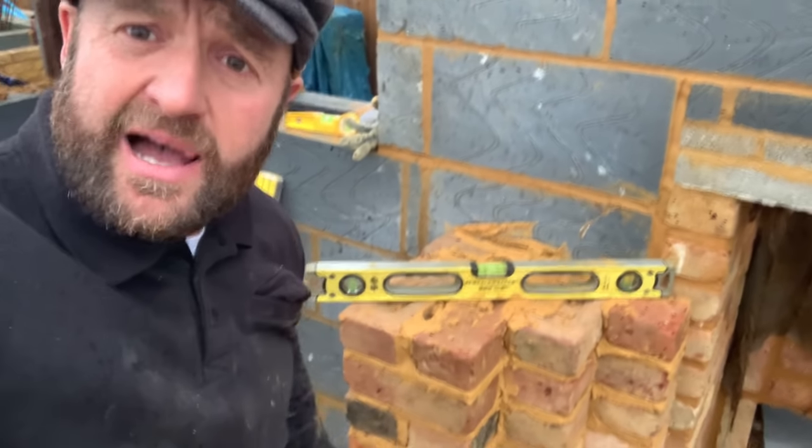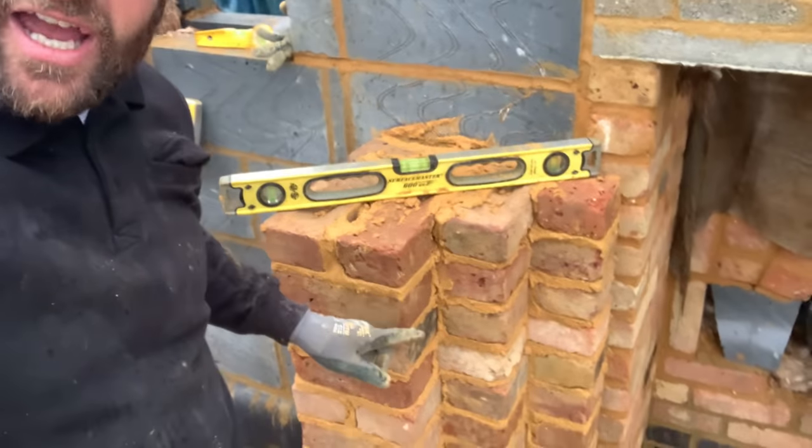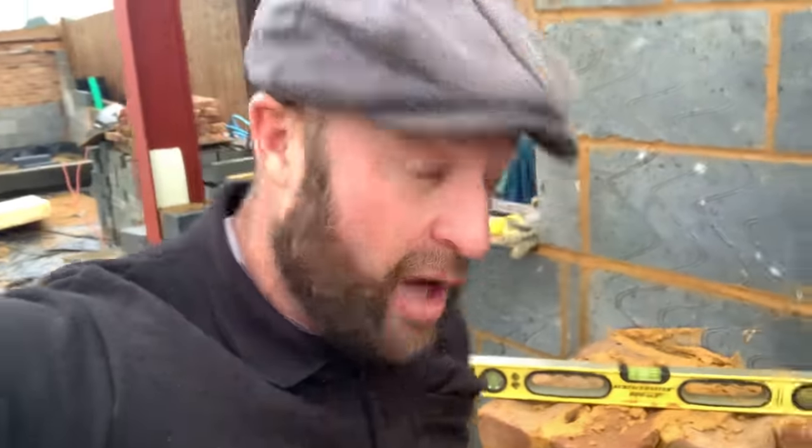So an experienced bricklayer will feel our pain. Doing this detail with stocks is really hard because the stocks are so inconsistent. So you have to empathize. You can't beat yourself up on this, guys, yeah? You let your eye be your guide on this. A lot of sighting and be forgiving.